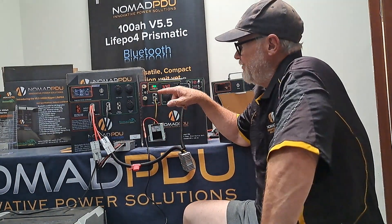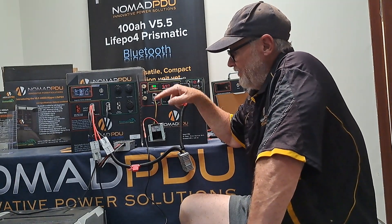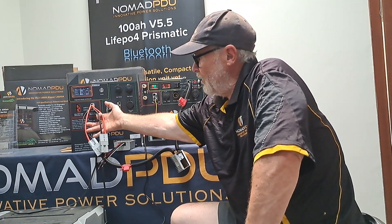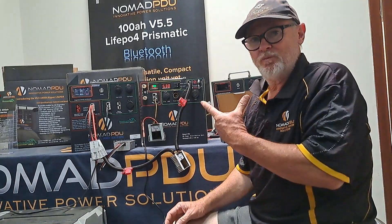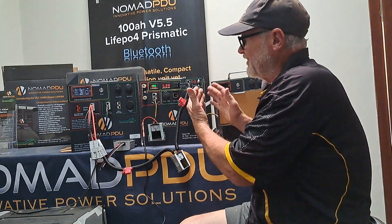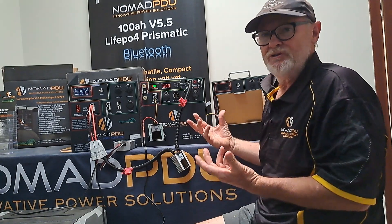As you can see, that's a 5 amp module, so there's a conversion cost. That's actually taking 5.4 amp out and plugging in — that's charging at 10 amp, there's another 5 going in, so I've got 15 amp going in total. I could add a solar panel up to 300 watt into that on top of everything else going on. So technically speaking, if I was running these in parallel the traditional way I'd have a master and a slave, but doing it this way we can pretty much use everything.